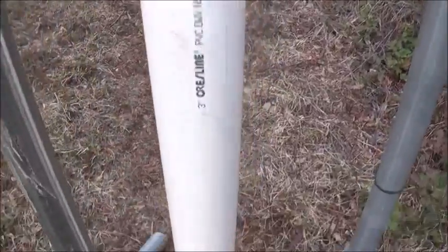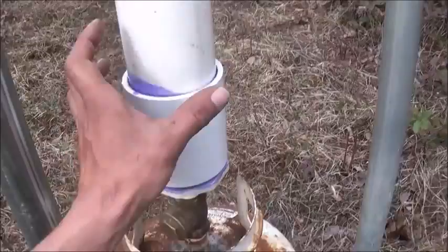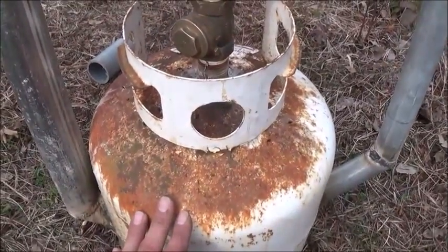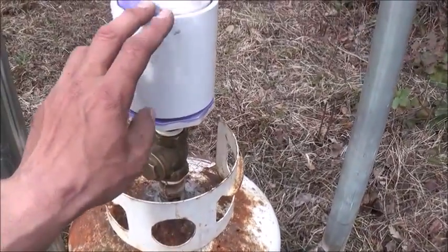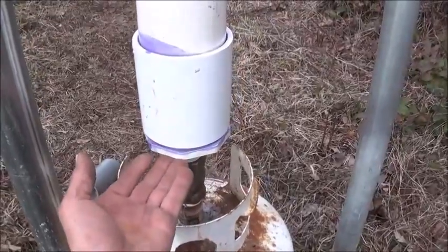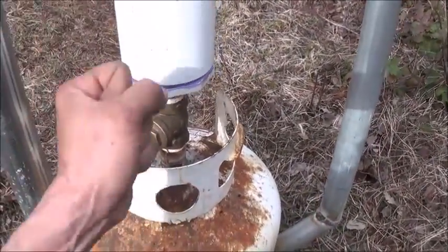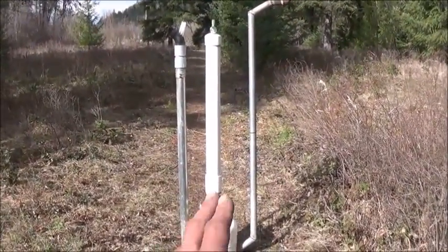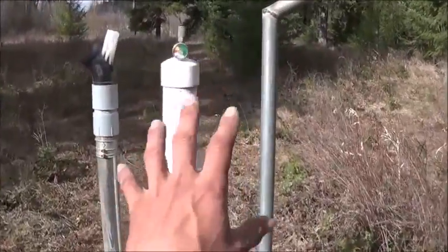Once the upper cylinder is full of air and the pressure is greater there, this one-way valve will close, capturing that air in the upper tank and making sure nothing from down here at lower pressure can get back out once the water ram effect takes place — locking it into place. Because once the water ram opens back up, the pressure would be lower, and if you'd built higher pressure up here, each cycle could blow water out and lose its gains.